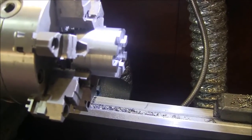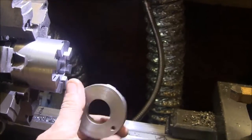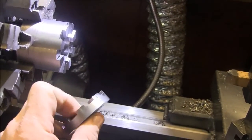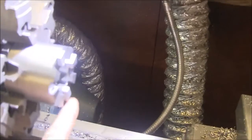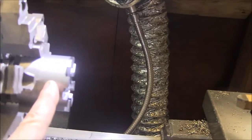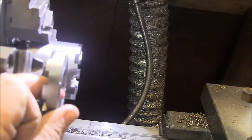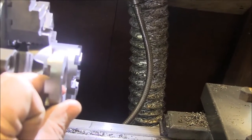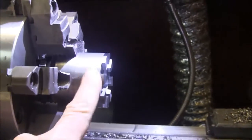So I got this blank now — it's not a blank anymore, but here's the mate to it. This piece here, thickness-wise, is a half an inch, and I want this one to be about a half inch too, and I want a five-sixteenths groove down the middle. So I'm going to cut the groove first, then part it off to the final length, then stick it back in the mill, make one of these on the other side, and then the shifter part will be done.